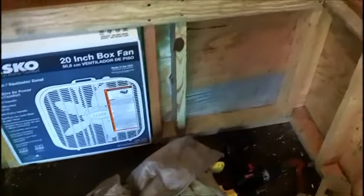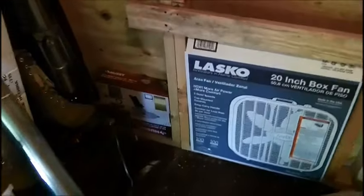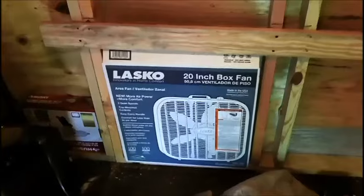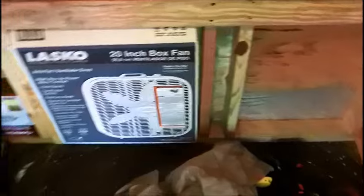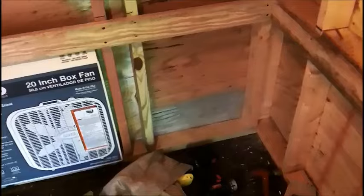Alright, I've got the top on the outside. I found a 2x3 that I'm going to put on the front edge instead of a 2x4, because I don't have one long enough — it's got to be 47 inches, allowing for the end piece. And then I've got some 2x2. If I don't have enough 2x4 to support the middle of it, I'll use a 2x2 in there. But the front part is going to be a 2x3, and that will give me more leg room.